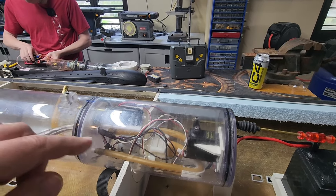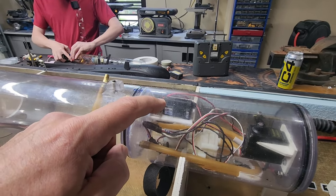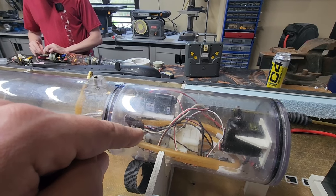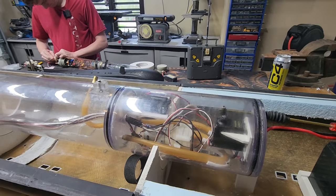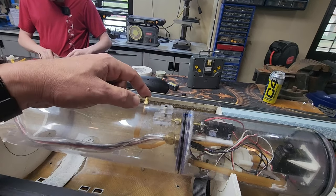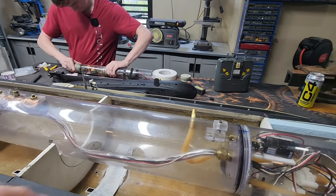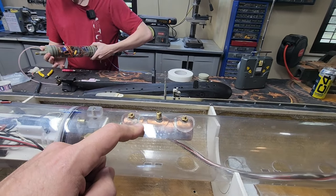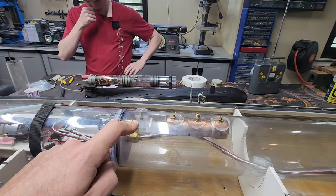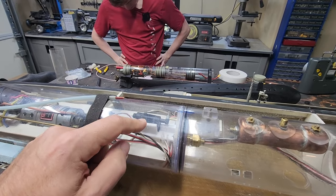This is the first time I've seen this cylinder, but this is pretty standard Dwayne setup. We got a forward servo for the dive planes, a linear servo for the ballast system, and then we got our air pump for the ballast system. Now I'm interested in seeing how quickly this fills or empties the ballast tank out. That'll be interesting to see. That's the intake for the air pump that gets connected to the upper hull. Big ballast tank, gas backup. Oh, I see. So he's actually got two vents. He's got a forward vent and a stern vent. So that's cool. These little linear servos are not cheap, by the way. I think they're like $50 or $60 a piece.